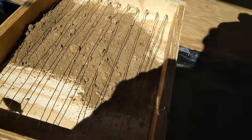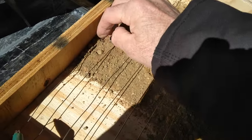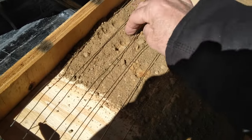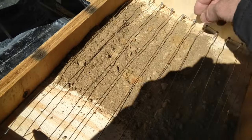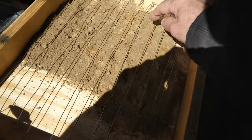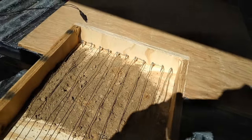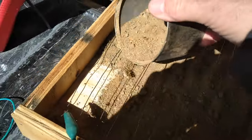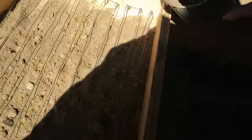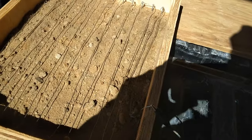It's not just sand — it's sandy clay. I don't have a real fine sand. Coarse sand isn't great for thermal conductivity; it almost acts more like insulation. You need really fine sand for that. So this is a mixture of sand and clay — kind of what they call cob — and it works well for thermal heat storage. I'm just going to pack it all around this wire, and the wire will heat it up from the power of that solar panel.